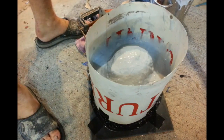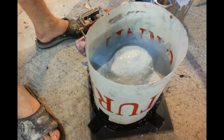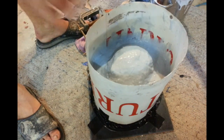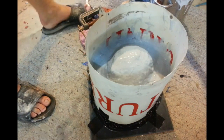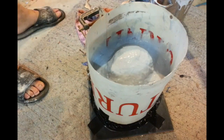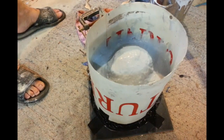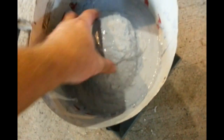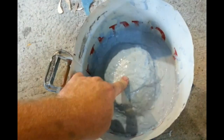At this early stage it's looking like a fail, but time will tell. If I get a good enough skin on the top there — if that skin stays thick enough — then I should be able to do a mother mould over the top of that. I've left this overnight to give it a good chance of setting and there's a nice thick coating on the top of the skull there.